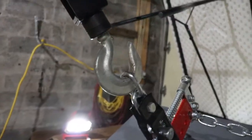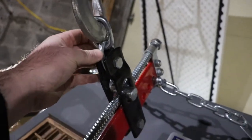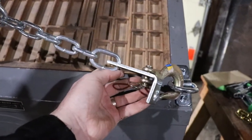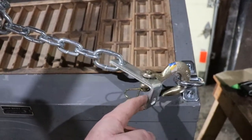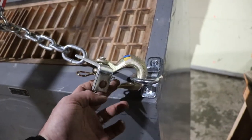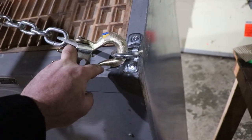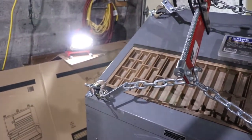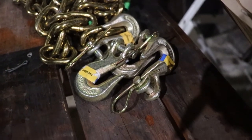The hook on this thing is just ridiculous — you can't fit anything on it unless you have some gigantic chain. The engine adapter helps a little bit, but it only has L-brackets so you still can't really lift much with it. So I bought a bunch of hooks. I would have preferred ones with keepers, but you could tie a string around it to mouse it so it can't slide out. I'm not lifting things very high — it's not getting loaded onto a ship or anything. I also bought another style of hook so I can grab into a chain.